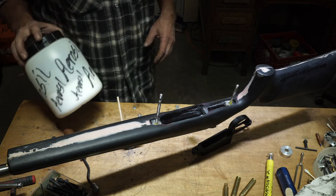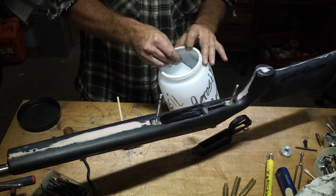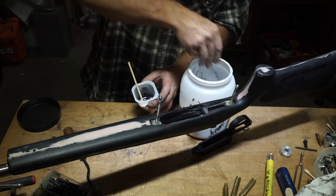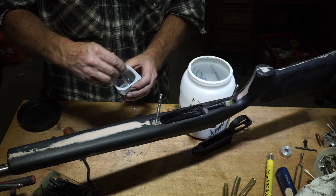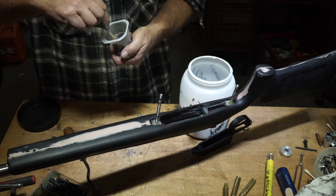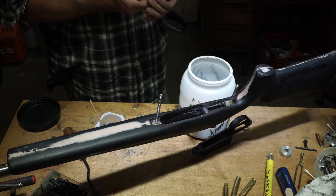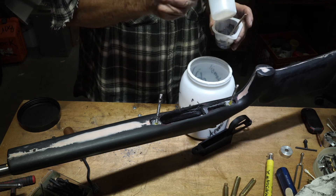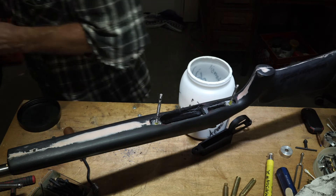Here's the tricky part. Some of you have seen this before — Cabosil or aerosil. These are fumed silica, and it increases the property that is properly termed thixotropic. Which means that with this mixed in, it will stay right along with the rest. You can put this stuff in place and it will stay there — it no longer dumps out. I could hold it like this forever, kind of like when you go through Dairy Queen and they flip your cup over. We're increasing the thixotropic properties of this so that I can put it in there as though it were AcraGlas Gel. If any of you have ever used AcraGlas Gel, this is going to be very similar.